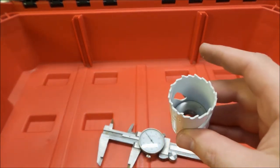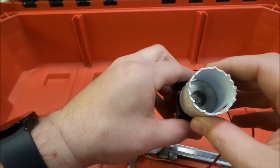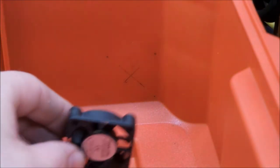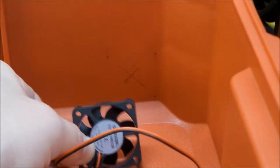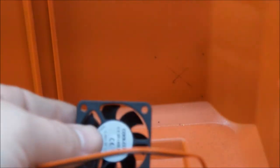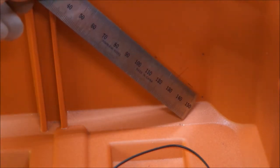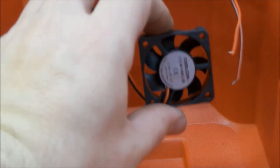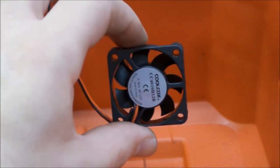So that's going to work out nice. The next thing we need to do is figure out our proper layout position for this center wise, and we'll take some measurements and get all that marked up. It's a little hard to see what's going on here, but what we did was we held one of these down here where it fits best, and then took a metric transfer punch, and one that just fits this hole, transferred these holes to the back plate here, and you can see the four holes. That one's not overly visible, but it's there. And once we had the four holes marked, we took a straight edge and matched the two holes across to find center. So that's where we're going to drill our hole saw hole. And then we'll get one mounted, and we'll set the other one on top and repeat the process.